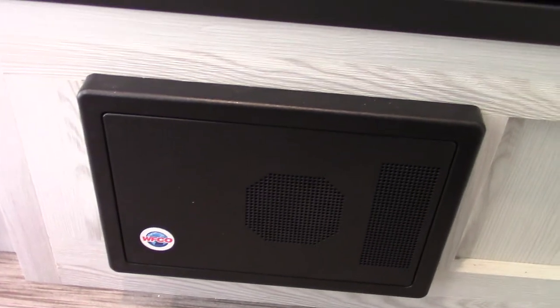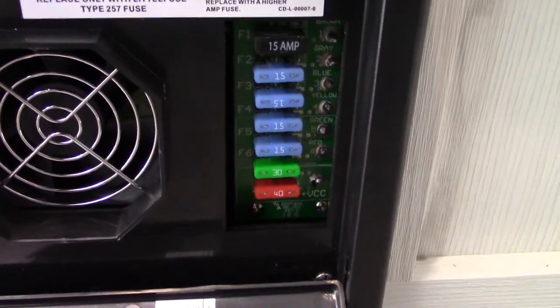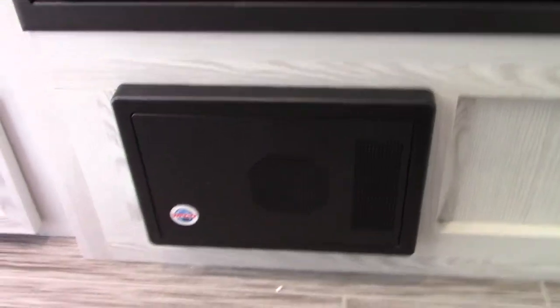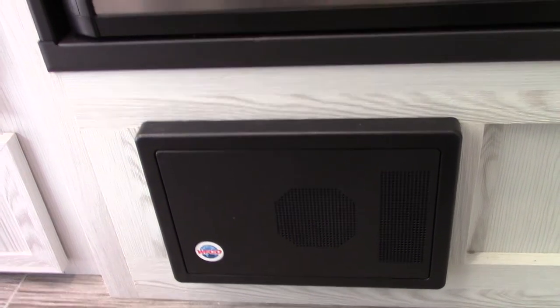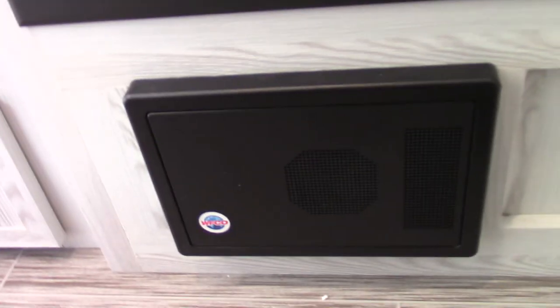This device is a power converter — the opposite of inversion. It converts 110 AC to 12 volt DC. On one side you have regular household 110 AC circuit breakers, all labeled. On the other side, power is converted to 12 volt DC with regular 12 volt fuses — if any blow, they'll light up and you can see them through the perforations. As long as you're plugged into shore power, this will also keep your batteries charged up front, acting as a battery tender.